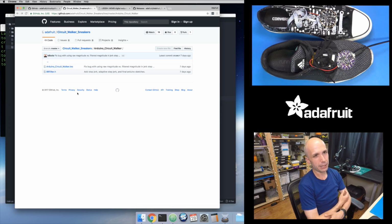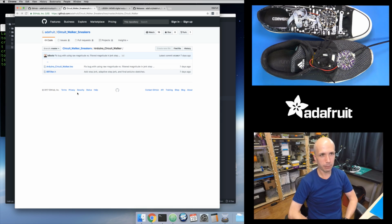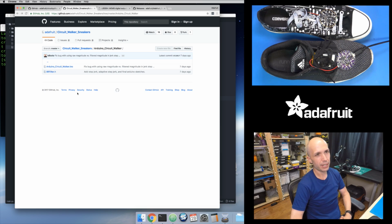And there is a limit to how fast I have to be able to do that in order for this to work, because this code, the Arduino version, samples 50 times a second, and it applies this 3.66 hertz low pass filter. And that filter actually depends on the sample rate. So if I can't sample 50 times a second, I would actually have to change my filter and adjust its parameters to what my sample rate actually is. Let's say I can only sample maybe 10 times a second. Then I have to change my filter. My filter actually might get more complex because of that.